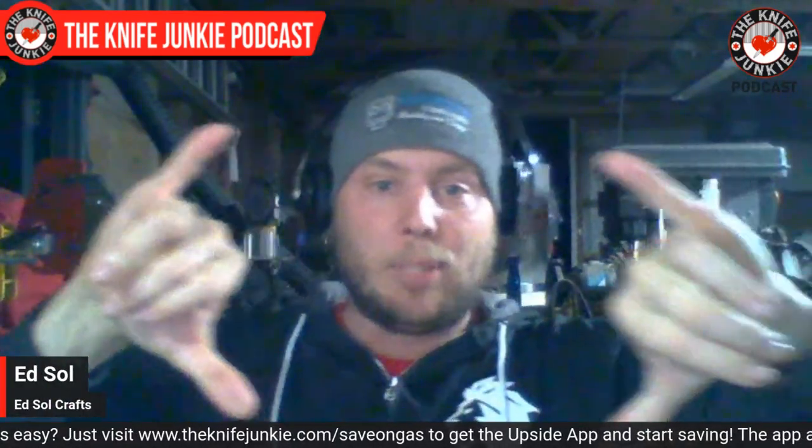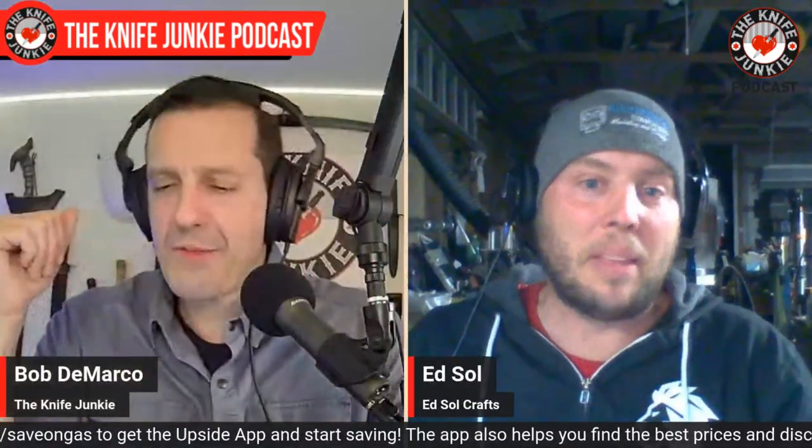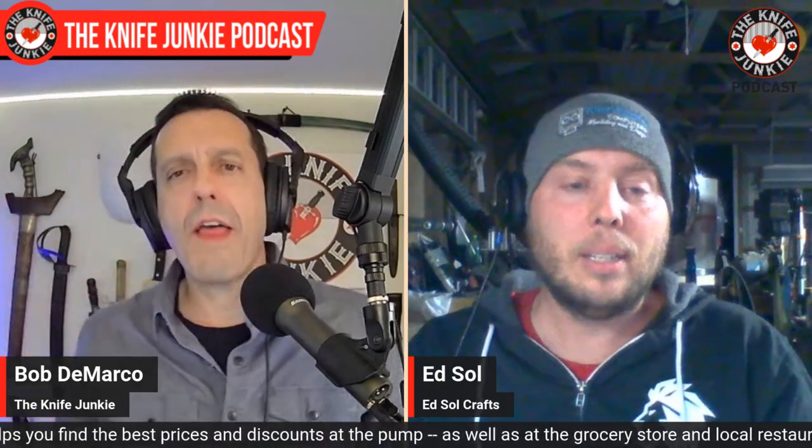That is so cool. How big are those bearings? They're enormous — the rings are about as big as my head. And I cut them in like a sliver — one of those bearings will make 20 plus knives. I'll cut a quarter-inch sliver off that whole thing, heat it up, and from there I've got a beautiful starting position to draw the tang and make the blade. I've got a hydraulic press and a tire hammer, so it takes me less than a beer to get the rough shape in.